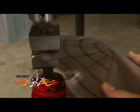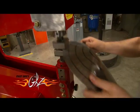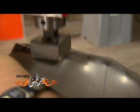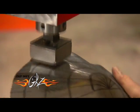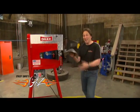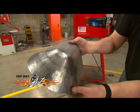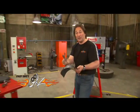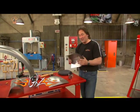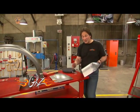With each consecutive pass, just work more out to the edge, shrinking the edge, and in a few minutes you'll have an incredible shape taking place. Once again in just a few short minutes, you're ready to take a look at it — look how much we actually shrunk that metal down. We could have kept going; you keep running it through and it'll just keep shrinking. Once you have your shape roughed in like this, all you have to do is roll it through an English wheel to smooth it all out, or put on some planishing dies and you can hammer it out smooth.